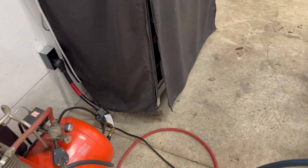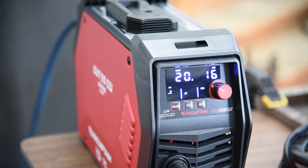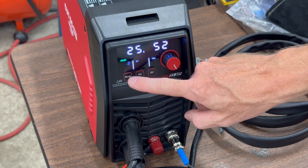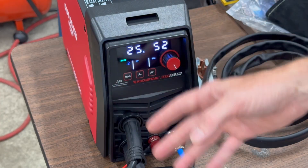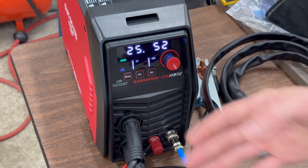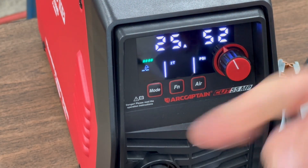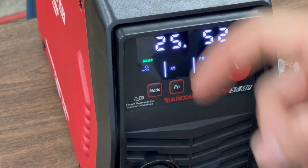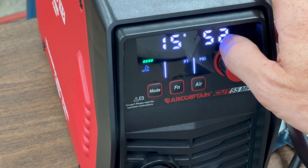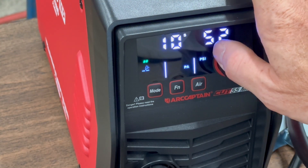We're plugged in and using 220 today to take full advantage of the power of the machine. This plasma cutter has four different modes. Right now we're in cutting mode. This is grid cutting mode for using on something like rebar. Here we have air planing mode. And this one I'm excited to try — rust removal mode. Over here we're currently in 2T mode, which will stop as soon as you release the trigger. 4T means you have to push the trigger again to make it stop — I'm more of a 2T guy myself. PT will allow you to set the post blow time in the machine in seconds between 5 and 15, and PA will allow you to set the post arc time between 2 and 10 seconds.